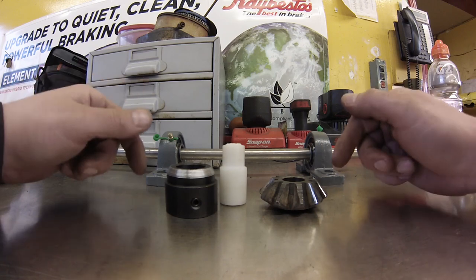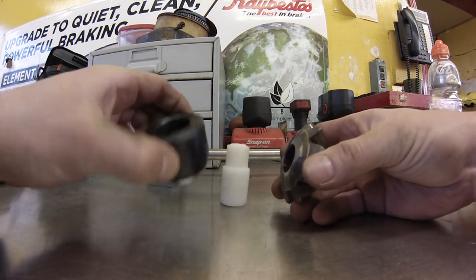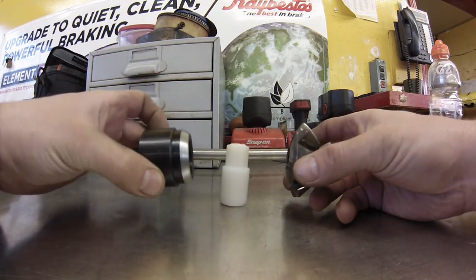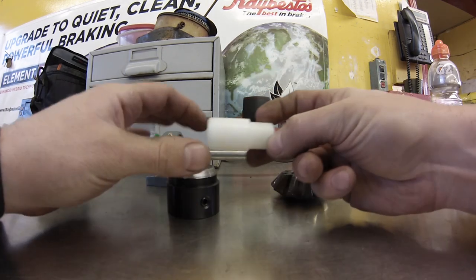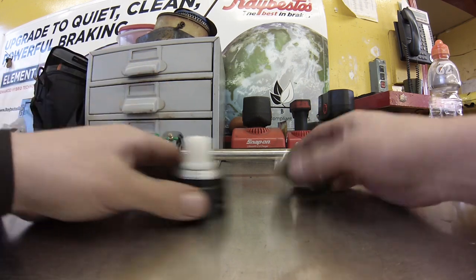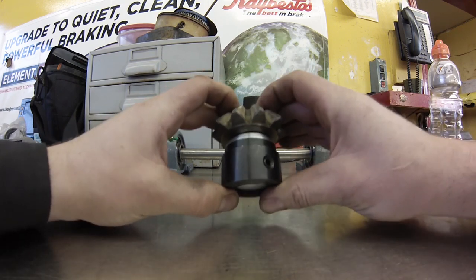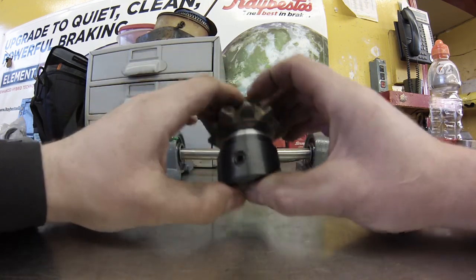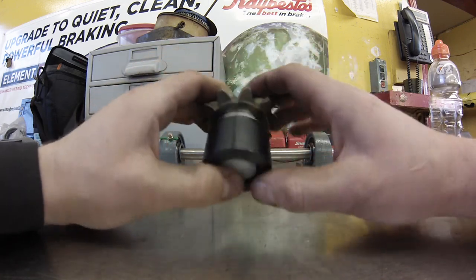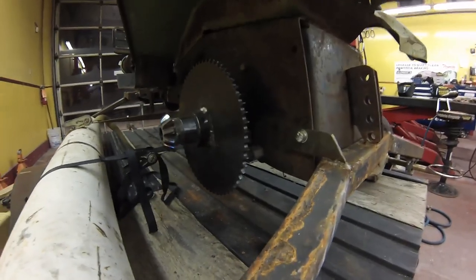This will be the setup for the drive gear — the smaller of the two gears — and I'm going to weld it to this one-inch collar because that's going to slide onto the axle of the tractor. I made this little plastic plug on the lathe that slides in nice and tight and allows me to center everything up. I'm going to press it in, pull the plug out, and then weld it along there. Hopefully that's going to be strong enough — time will tell on that one. So that's going to be the drive gear.